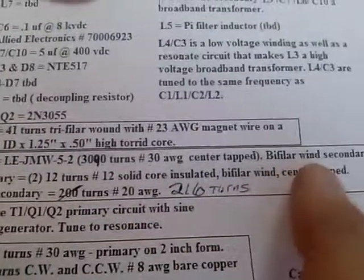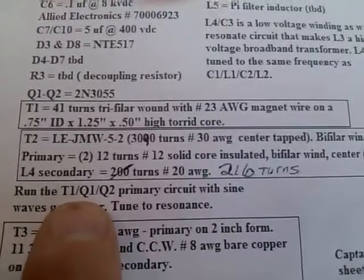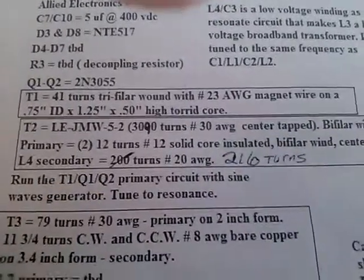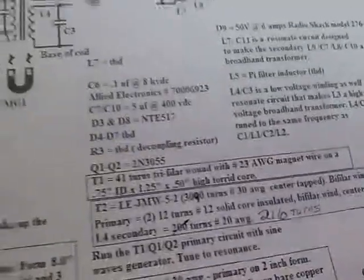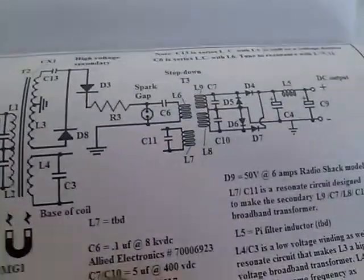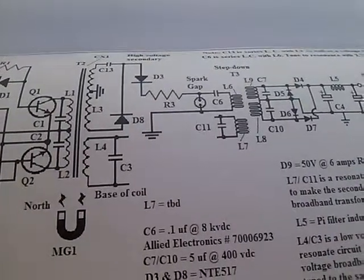The wellness T2 — we spent a couple days on it and it was very disappointing; it didn't work. We had some internal shorting, and we did a bifilar winding. I don't think you want to do a bifilar winding — you want to do one winding only, like Linda did. We have another AC flyback on order. I'm going to try that, and then we'll probably wind our own flyback and go from there. So there you have it.